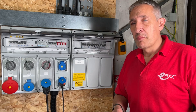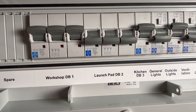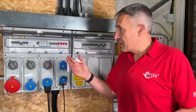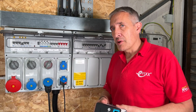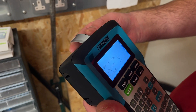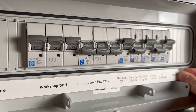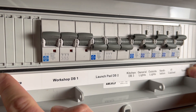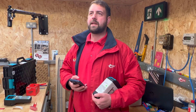Here we've got a slightly more complicated labelling task. This is a Topter distribution board and inside there's a combination of DIN rail modules — single, triple and quadruple pole devices doing different things. We've got surge protection in there and an RCD protecting a number of the outgoing MCBs. We could do that as individual labels and try to get them straight, but as we've just seen that can be a little tricky, so this is an ideal opportunity to step up to the Thermomark Go. It looks like a desktop version here, but you can also get a handy holster so you can hang it around your neck and walk around the site with it.